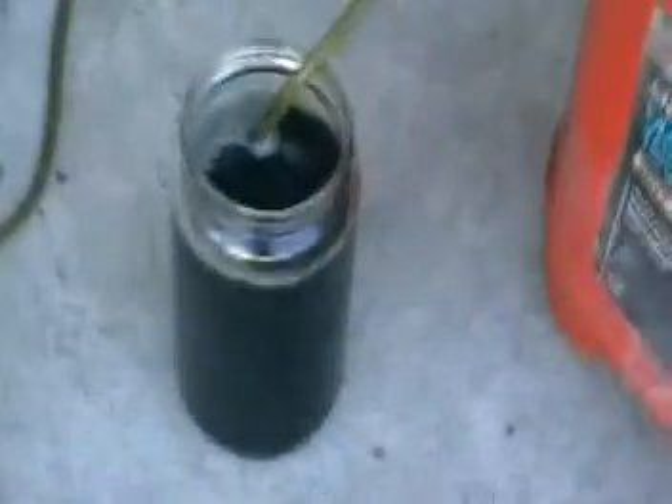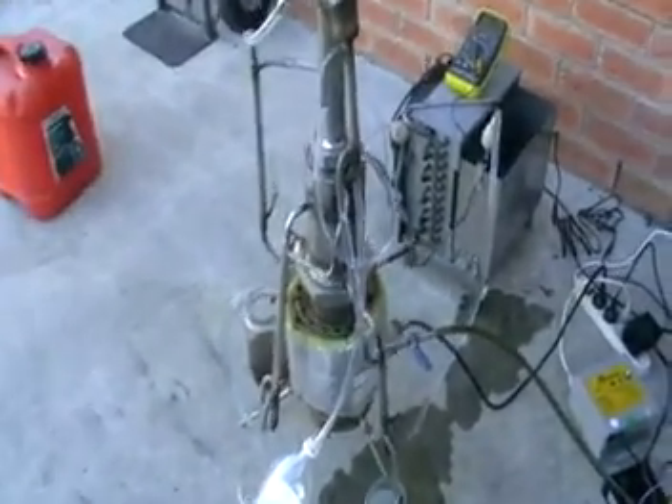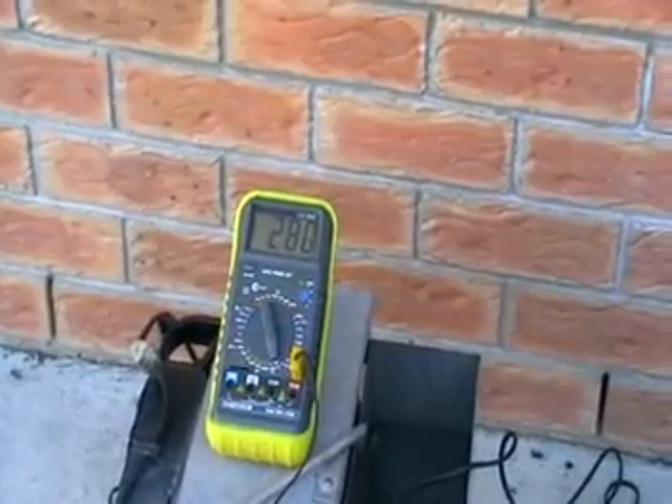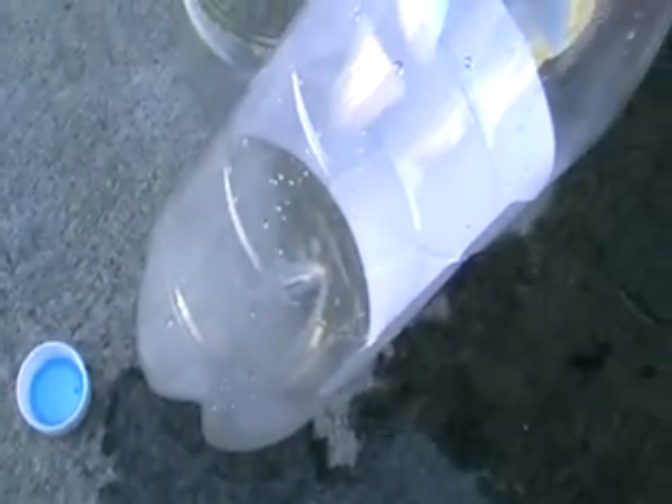It is a sour oil, it is very dark, so we are pumping it through the system continuously, keeping the temperature — it is quite high now, 280 degrees. This tray is still flushing, it is quite dirty inside, the lowest one. This one got just one drop only — no petrol — because we are running it at cooler temperatures, no reforming as such. Just cleaning and removing the carbon.